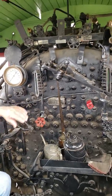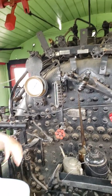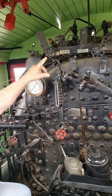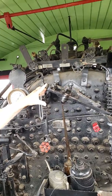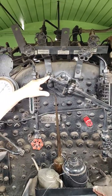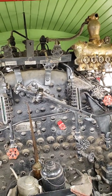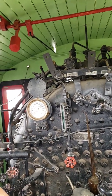But then you got your auxiliary valves up here, fireman's manifold, the generator. The hydrostatic lubricator valve is missing. That's the big brass thing up there. The pump is the steam-driven air compressor. And the water glass. There should be another one up here that has the water glass to turn on the flow to the water glass.